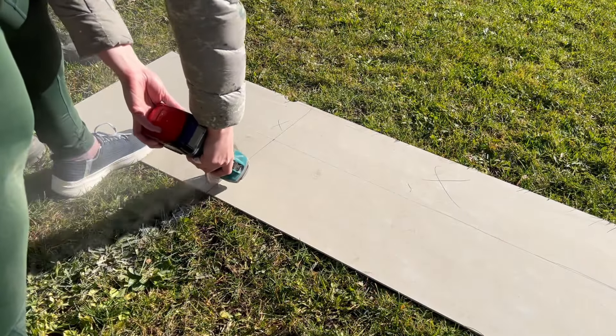The most important thing to get correct when you start tiling is your levels, so I've used a laser level to get all the levels correct around the room. In order to get those levels correct and make sure my first tile was going to stay level, I got a piece of timber and cut a whole lot of little pieces to chalk that up to size, putting them on each of the corners almost like a frame to sit the tiles up against so they weren't going to go anywhere and would all be level. I applied the tile glue onto the wall, also applied tile glue onto the back of the tiles, and then applied the tiles onto the wall.